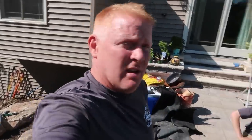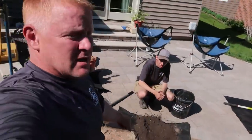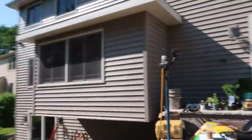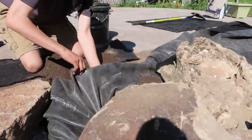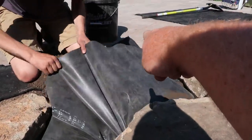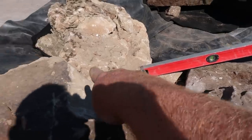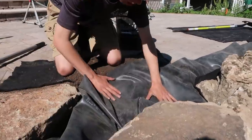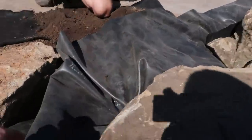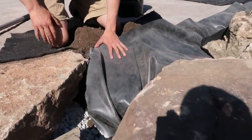Because you asked for it, we're going to film Jack over here — he's working on a unique edge situation. So many of you want to know about edges and different edge treatments. Jack, what was your question for Chris? Show them where the liner came to — the liner actually came all the way up to the patio originally. Here's a unique area where the patio is quite a bit higher than the back edges of our stone, but the water level is a good 10 to 12 inches lower than the lowest part of those back edges. One quick and easy way is to pull that liner back, get it flat, and cover it with gravel. Show them how the folds stay up — this is the overlapped liner and we want to keep all of that up.